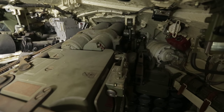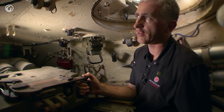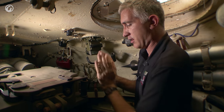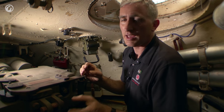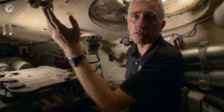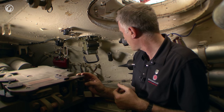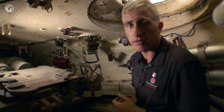Just looking briefly at the breech — it is a horizontally sliding breech block. The operating handle is here; you lift up to swing it around. It is a little bit annoying to get back into place. There is an internal travel lock — a simple clamping mechanism comes up here and intersects with the lock on the roof. Dome light. That's it for the turret of the T-55.